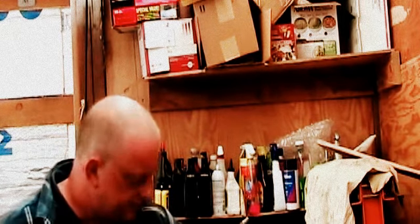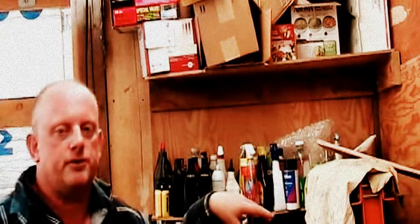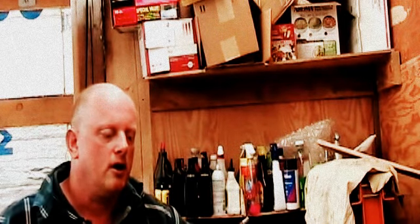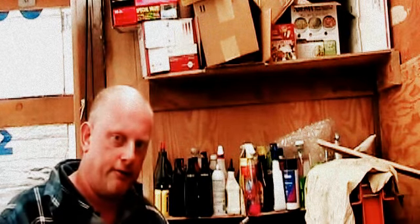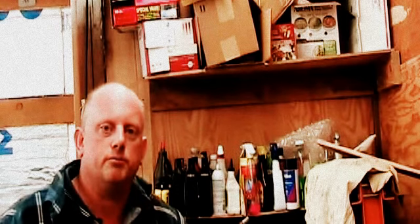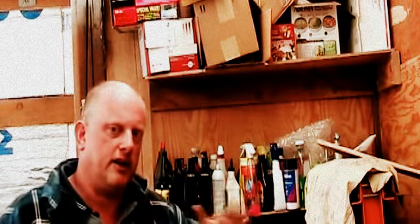Anyway, just wanted to show you this washing machine I put together, crudely made. It'll wash a few clothes at a time. It'll agitate. And that's the other thing you might want to think about if you can find one. You could even use a small 120 volt motor, or if you want to get really down and dirty, get a battery operated reciprocating saw like the battery operated DeWalt's. Somehow mount that onto the frame and then mount your plunger handle to that and use the variable speed on the DeWalt drill, or the DeWalt saber saw, to control the speed of the agitation, because it's going to have like a 1.5 inch, 2 inch stroke, but you get it going, it'll probably do a good job.